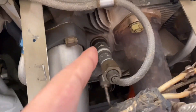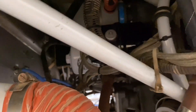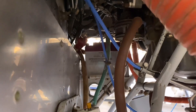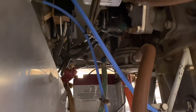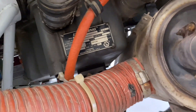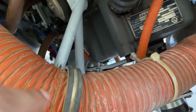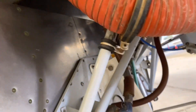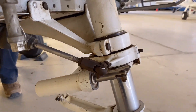These are the spark plugs right over here. That is your magneto over here — this black one — and that's the other one on that side. You can see it's written 'Champion' over there. This is the Lycoming engine. The shroud is connected over here — it's gonna take air for the defrost and heaters for your cabin. That's your shimmy damper for your oleo strut for the nose wheel.